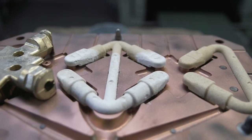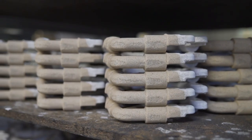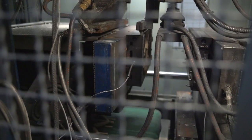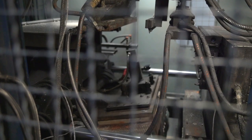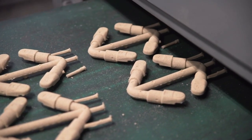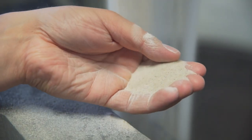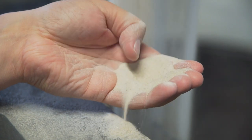To start off the production we need a core made of silica sand. It is made inside this machine, where under eight bars of pressure the sand is injected into the mold and then bonded at temperatures ranging from 240 to 320 degrees Celsius. A special kind of silica sand is used, characterized by its high resistance to chemical compounds. During the casting process there are chemical substances and gases which need to be reduced to the minimum, which is why it's important that the sand has a spherical, hard and resistant surface.